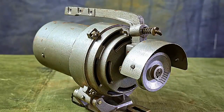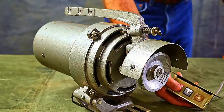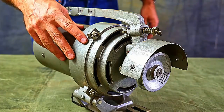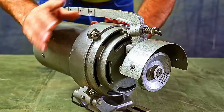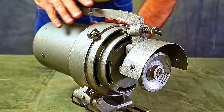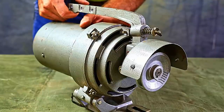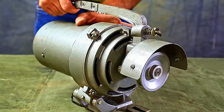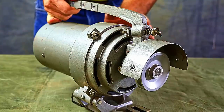Now that you've seen how it's put together, I'll just show a close up of its operation. I'll turn it on — so you can hear it running. That cork clutch is spinning on the motor now, and then there's a steel plate that is pressed against it when I push on the foot pedal. This is upside down compared to what would be on the machine, but when you step on the pedal it moves in this direction and it engages the clutch. You'll see this start to spin. Then when you need to stop fast, you just push your heel down and there's that brake in there and it'll stop instantly.